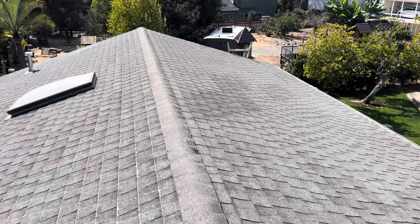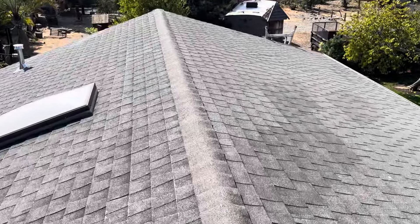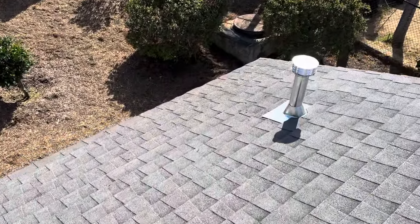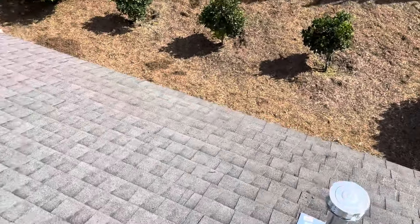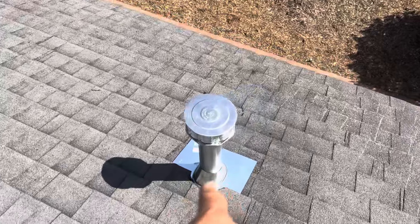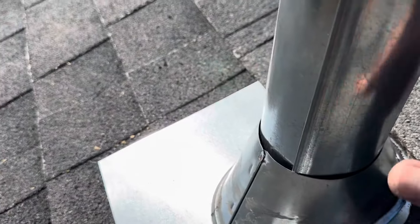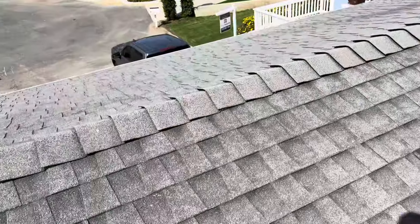In my professional opinion, it is time to replace this roof. What we want to do is tear this down to the wood decking, and once we do that we are going to address any of the bad wood underneath it. Once we replace that bad wood, we will then install a layer of synthetic underlayment. As an Owens Corning preferred contractor, that underlayment will come with a 50-year warranty from Owens Corning. We're also going to go ahead and seal off this penetration — you can see how water and moisture will just get right down in there.